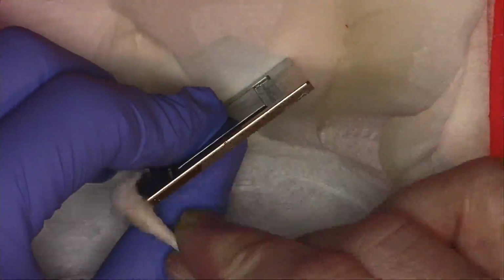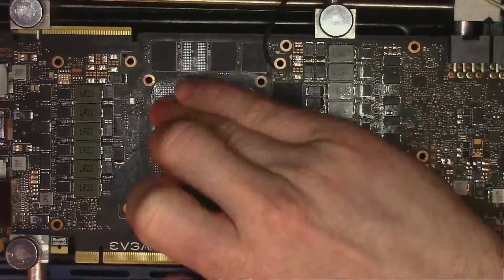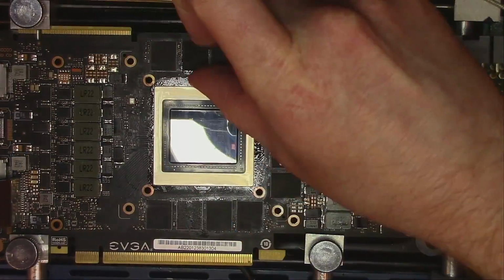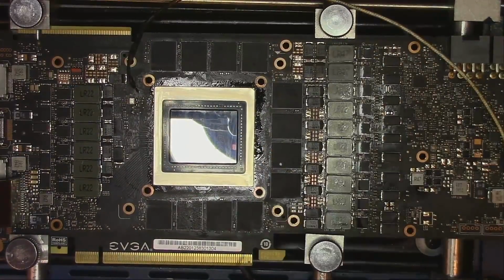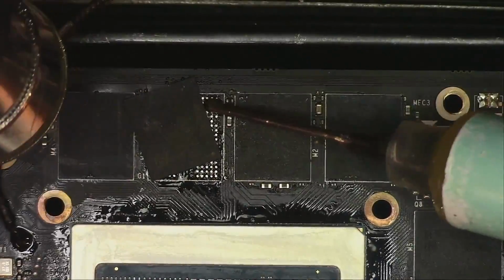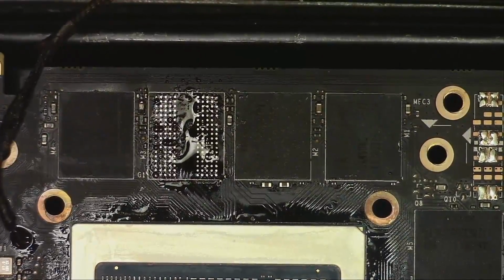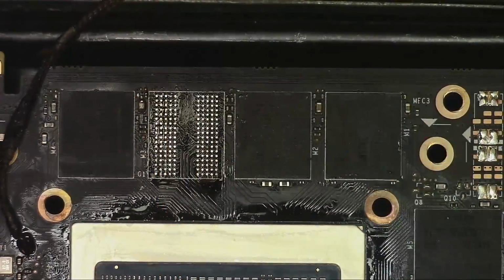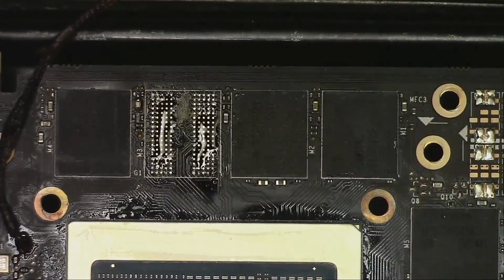Then the cleaning. Ultrasonic, if you have one, is always a plus. Apply a thin layer of flux and set the chip. I will try to solder this memory chip while the rest of the board is getting hot, and as you would expect, too much flux caused the chip to shift, so I have to reball it quickly once more and try again.